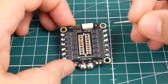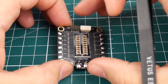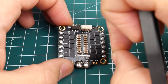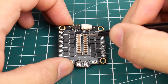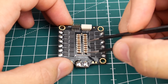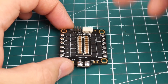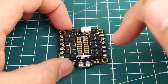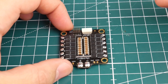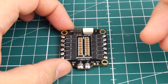As you can see, there's a nice large array of capacitors on the board. They're pretty small, but that's not an issue. The main problem with 4-in-1 ESCs is that they're so limited in space, and all these capacitors are working together to filter the whole ESC — it's not separated like five caps for this one, five for that one. All of them are working together for the overall ESC. This is both good and bad. We're going to test with one motor because I currently can't afford a multi-motor test setup.